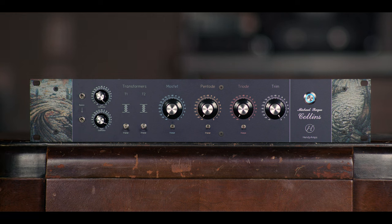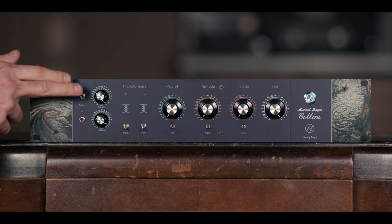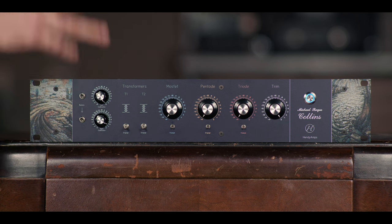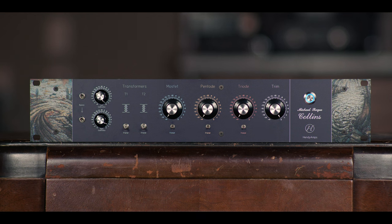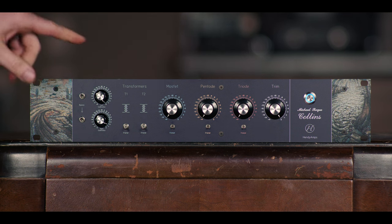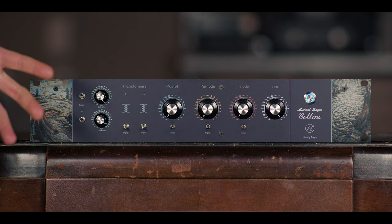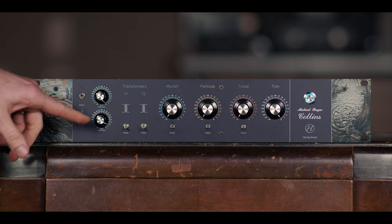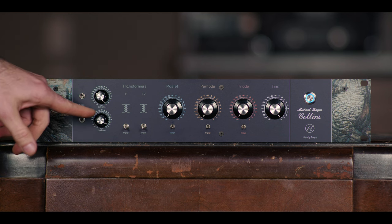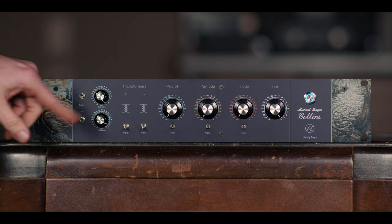All right, so starting off, just like with every mixed piece of gear I do, you've got the bypass switches. So they are true bypass, down, completely bypassed as if the XLRs just skip the whole circuit, engaged when they're in the up position. Now, this unit's a little bit different than the Michelangelo and the Pollock because this one I personally have intended for it to operate with the calibration knobs all the way up, but you'll notice this one's a little bit offset because, depending on how the tubes and MOSFET are working, you might need to tweak these a little bit.